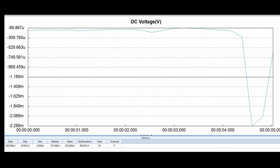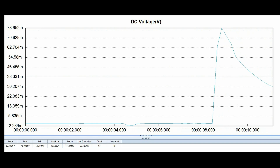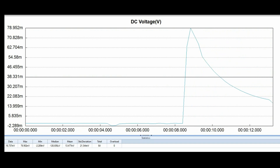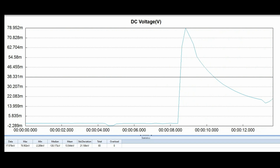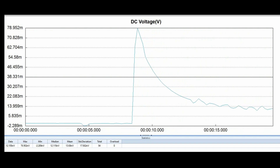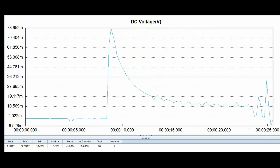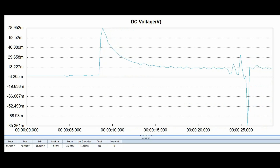I just powered up the SA-9900 and it hasn't come out of protection yet, so we're just reading random garbage at the speaker outputs. Right there it powered up — and you can see we had a spike up to just under 80 millivolts. That's normal, not an abnormal thing to see, because you can see it immediately started to fall back down. It's fallen down to about 13 to 15 millivolts of DC at the outputs — that's good.